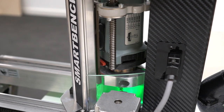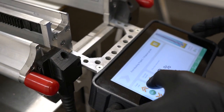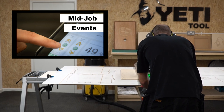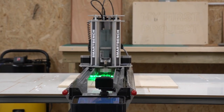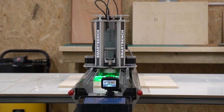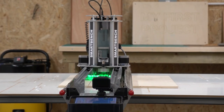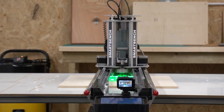You may need to reduce the feed depending on the material you're cutting and the condition of your cutter — you'll see me adjusting machine feed and spindle speed in real time. Our nominal CAD/CAM values typically need minor adjustment in real time to suit variation in material or cutter condition. The spindle needs to run at a constant speed with a consistent noise. If you hear the spindle tone dipping, your spindle is likely under too much load — a good first step is to reduce your feed rate. Other factors may include sharpness of the cutter or poor extraction.